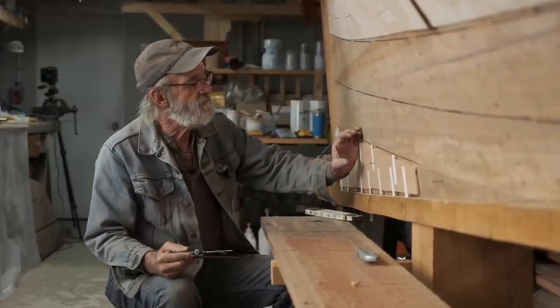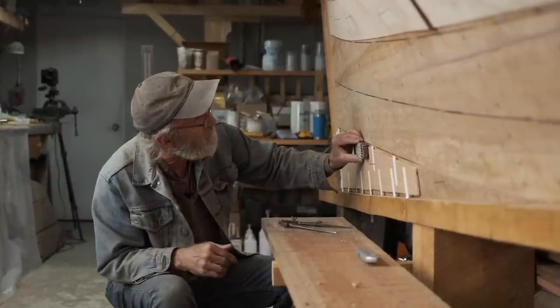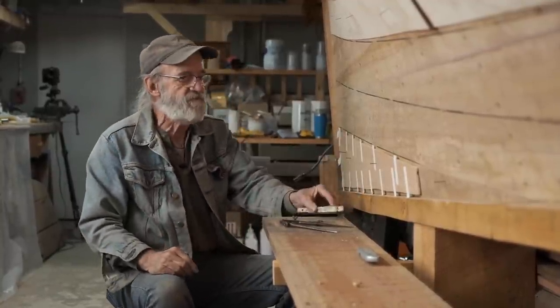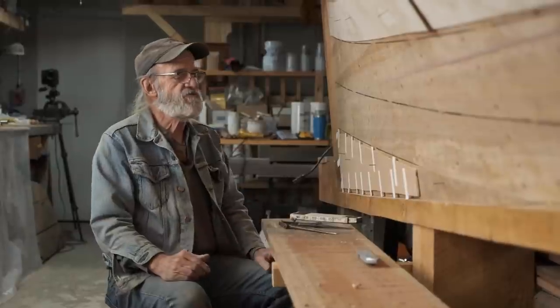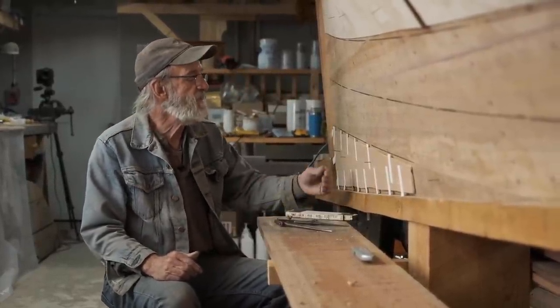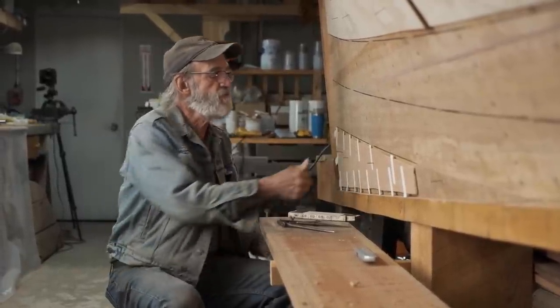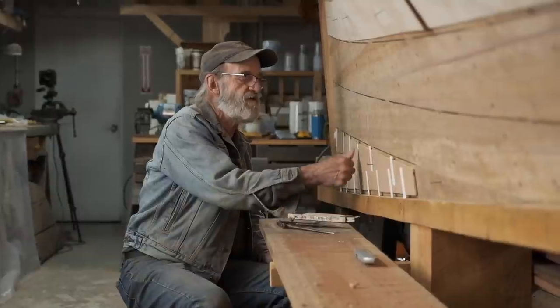You can use a little round disc. You can use a spiling block where you line a block up with the line and make a mark, and all kinds of different stuff. One of the things that's been done quite often is people would take a pattern like this and then cut strips of plywood and glue them on there with hot glue, the same as I've done here.